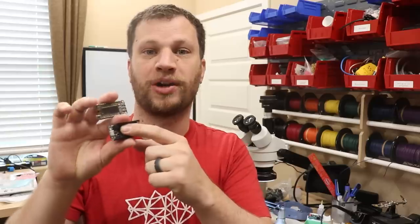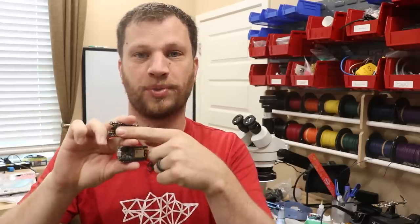The prototype that I built in part one of this video series used an ESP8266 microcontroller along with an OLED display. That setup would have worked just fine, but I found that I was already kind of running out of GPIO pins on that microcontroller, and also the OLED screen wasn't that big. It couldn't display that much information.